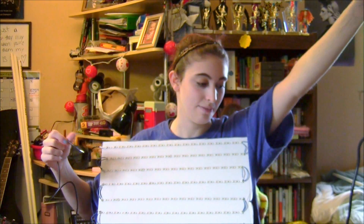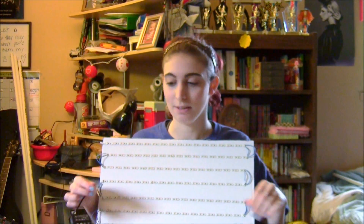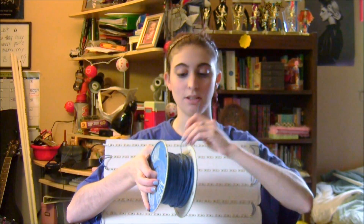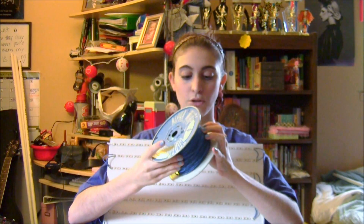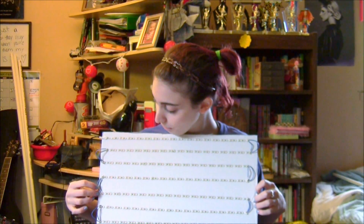Light strips are $5 to $10 depending on where you get them. Soldering materials aren't particularly expensive. This is a giant spool of blue wire that handles the current really well for a small wire. Don't go crazy with wire that's too big — the contacts on the LED strips are really tiny and you have to be very careful when tinning them. I used tin solder for this and think it worked the best.